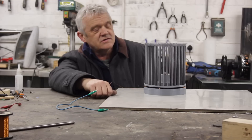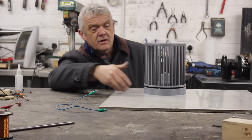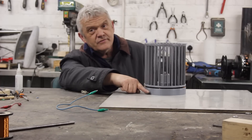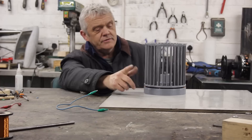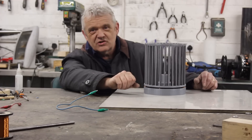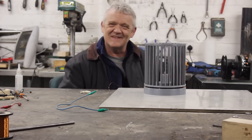I thought it performed really quite well given what it is, and it's a neat combination — the squirrel cage with the flat pancake generator as an all-in-one version. You could put lots of different turbines on here: Savonius, Lenz, squirrel cage, a fan — whatever you like. The whole point is to show a different style of incorporating the generator into the wind capture unit, and what maglev can do. If you don't like maglev, use a thrust bearing. I see this as a suggestion for improvement, not a finished thing. I hope you enjoyed the video — thank you for watching, and please do remember to like and subscribe.